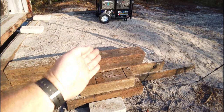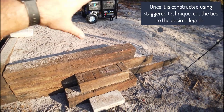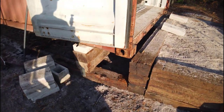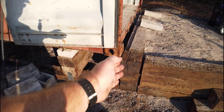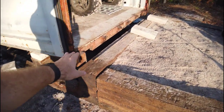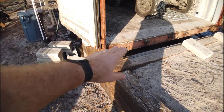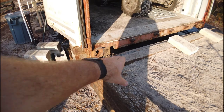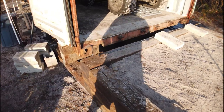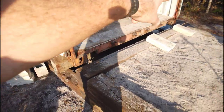I did taper the ends a little bit. I wanted some steps because you're always coming around the corners and stepping up, and it just makes it look a little better as the grade comes off the ramp. Getting started: this is where you want to begin — get your timbers aligned first and parallel to the bottom. If your container is level, the timbers should just be level. However, if your container isn't level but you level the ties, visually it looks wrong — so keep the ties parallel to the container.